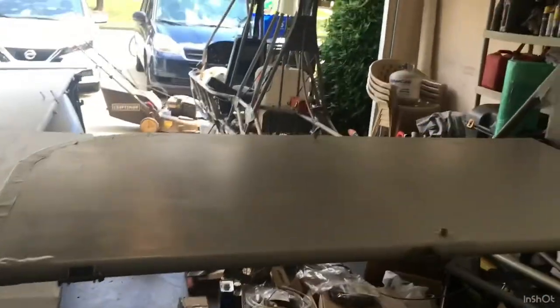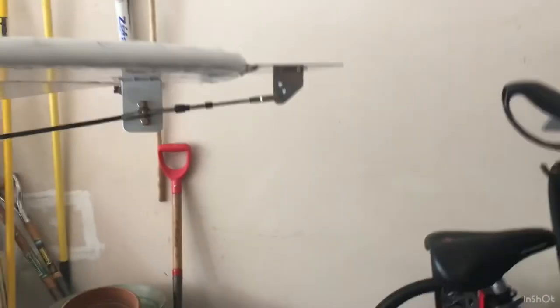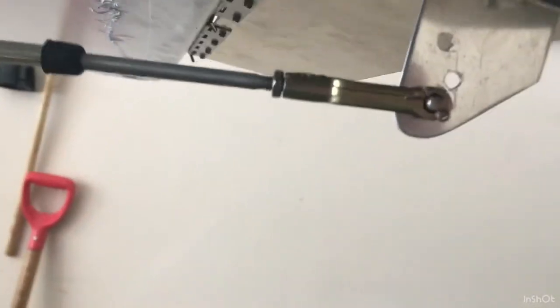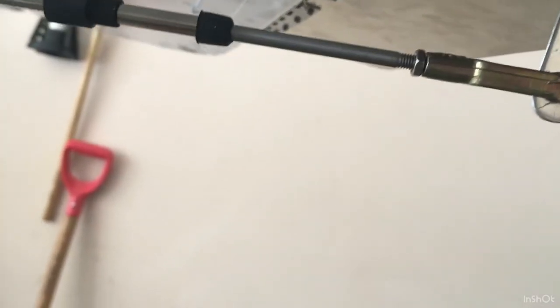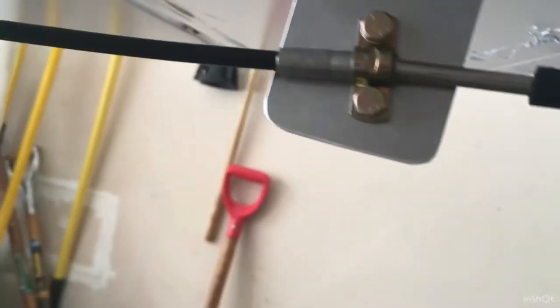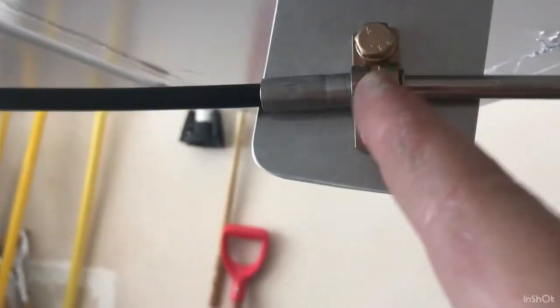Here's the finished rudder surface, finished horizontal stabilizer. The wing is primed. Cool thing is I have a new one of these from Tom that I messed up on by drilling too many holes and didn't feel safe about it, and he sent me another one which is awesome. Here's the elevator trim - I think I got it in the neutral position, and that works out great because the handle is almost in a perpendicular position, straight up and down. Just a little clevis head right there with a jam nut and a small tiny little cotter pin that you can see, and then you've got another mounting bracket right there that keeps the cable in place. It's a pretty cool design - it's got a little indentation that rests inside a groove in the middle, and that keeps it stationary. Then I'll zip tie it off nice and neat.